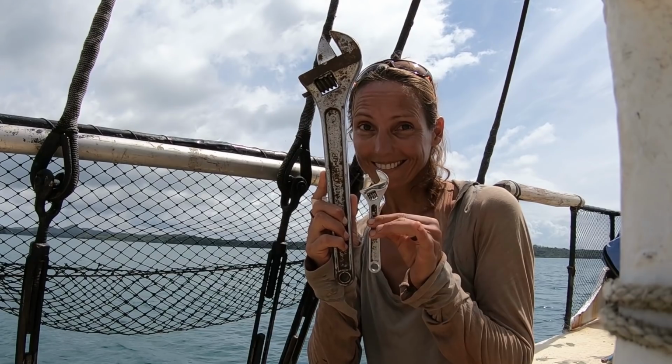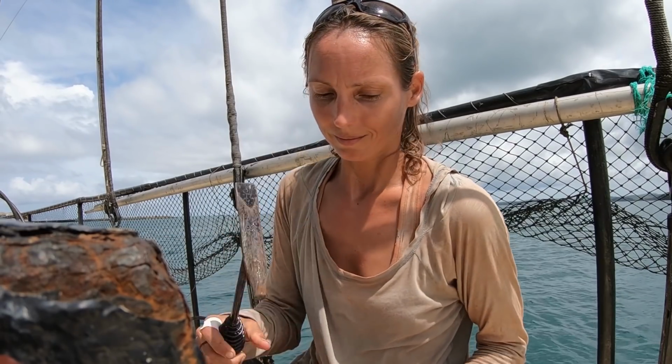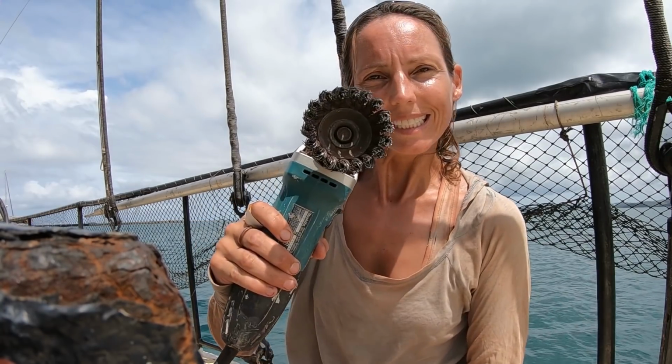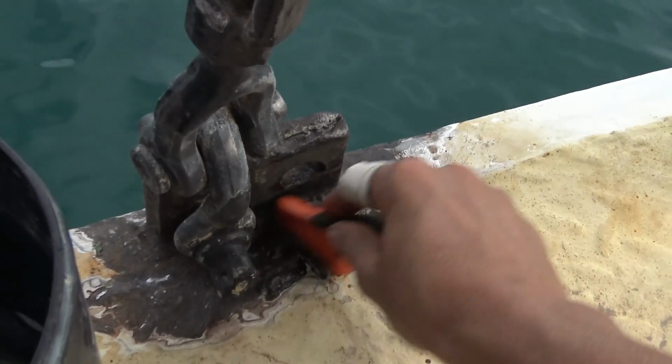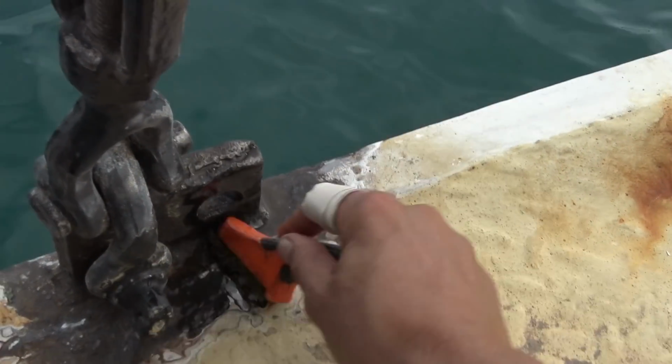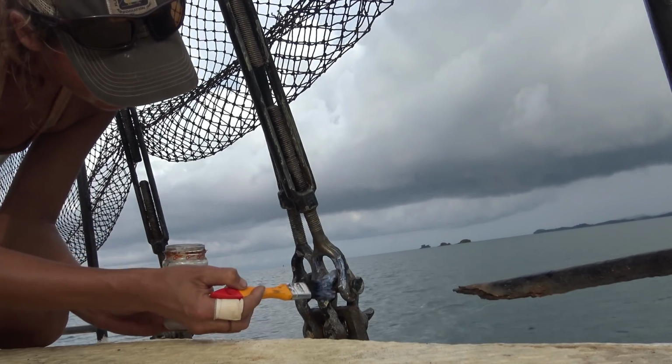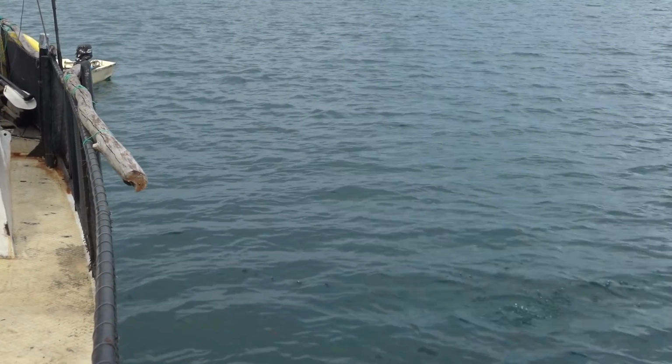So what I was told I'm supposed to do is, first I smack the metal with a chipping hammer, and then you brush it with a metal brush or with the brush on the grinder, and then we're gonna OSFO the whole thing with the metal brush dipped into OSFO, and then after that we're gonna put some coral seal on, so that's some kind of etch primer, I suppose. In the meantime, it's raining metal because Maria's up in the mast chipping away on the mizzen.